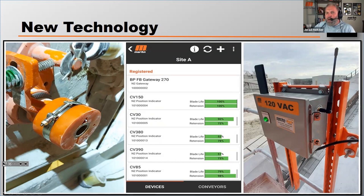As the blade wears, the mainframe rotates, and this unit measures that rotation. It then sends a radio signal via Bluetooth to a receiver unit, which communicates with the cloud. The cloud then sends information through a mobile app telling you how much blade life is left and what the tension status of the unit is. As the mainframe rotates, communications are sent back to a dashboard or mobile app notifying either the manufacturer or the maintenance crew that the blade is close to needing replacement.